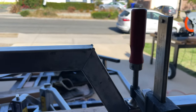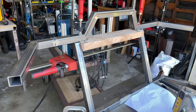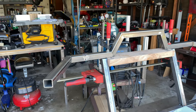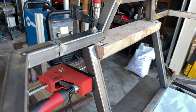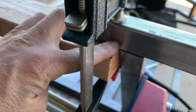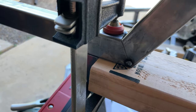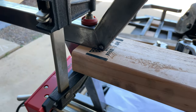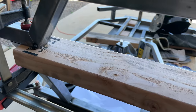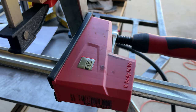I set this because it wants to fall off — this is a really hard weld, this is super hard. It doesn't want to stay on there and I don't have any help. I measured the even spacing on this side and this side — it's like 1 and 5 eighths, if I recall. I use calipers, split the difference, and get it right. Then I clamp to the piece of wood, so there's a lot of clamping going on.